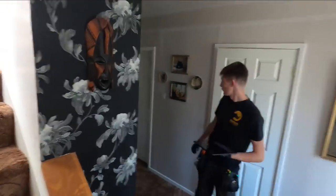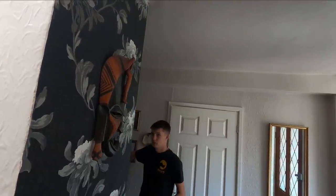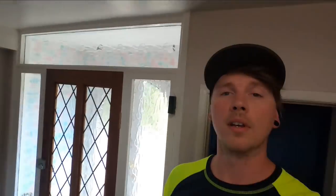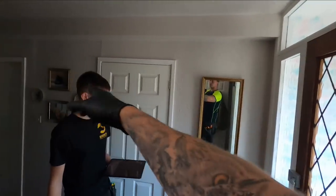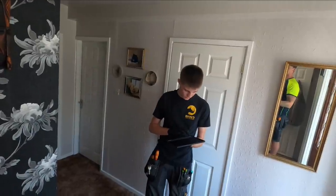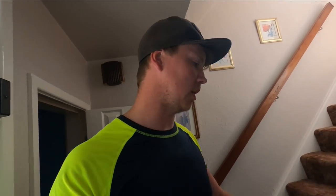So I'm going to replace that for a new one. In the hall we've got one wall light, and we'll be doing a switch there - there's no switch currently. That's a stud wall. We can reroute that switch, put the switch in there for that room, put a two-way here for the hall and the stairs - hall, one light, two-way switch.